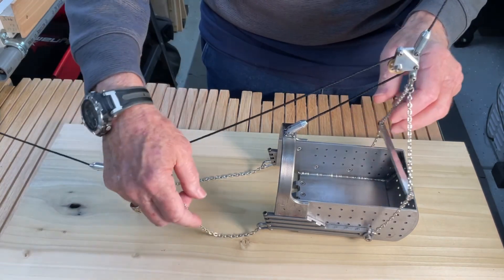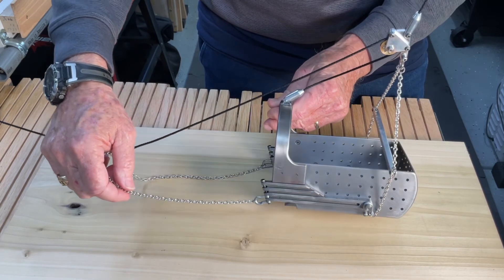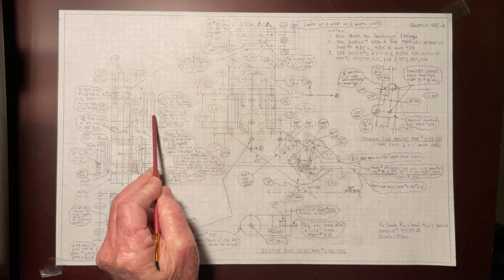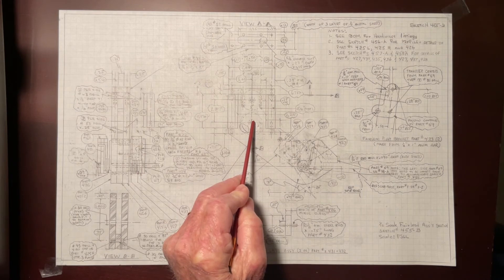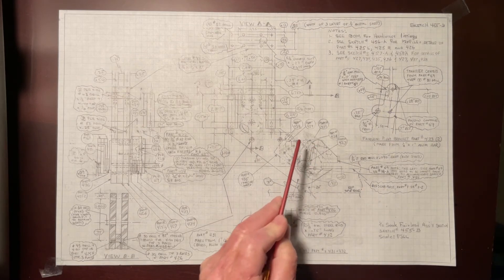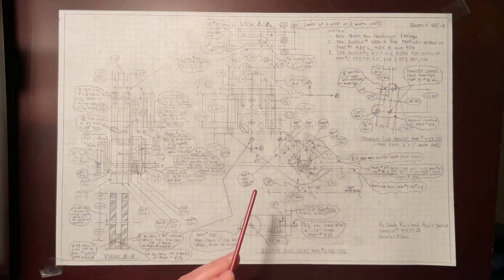The chains, clevises, and clevis mounts that I used are from my 1:10 scale Enidu trailer safety chain kit purchased online. The dragline fairlead serves to guide the return of the horizontal dragline to the reeling dragline drum. The fairlead style I chose to replicate has two forward and two aft vertical stainless steel pin rollers to provide horizontal line guidance, and upper and lower horizontal sheaves to provide vertical dragline guidance. I also designed the fairlead assembly to be rotated upward about a pivot point against two torsional springs, thereby tripping a model power shutdown switch should the drag and hoist lines ever become involved in a tightening tug of war.